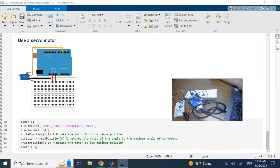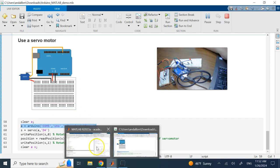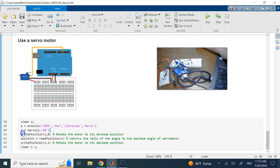Finally, the most requested feature: running a servo motor. When creating the Arduino object for servo control, you must import the servo library. I clean up the previous Arduino object and recreate it with 'import servo' so I can use servo commands. I then create a servo object connected to pin D4, which carries the control signal.